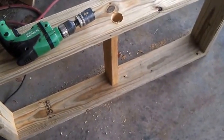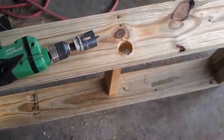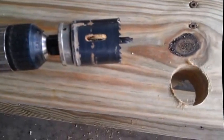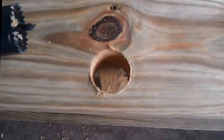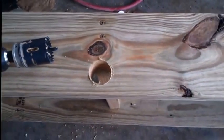After you have your center piece installed, you're going to want to use a hole saw if you have one. This particular hole saw is 1-5/8 inch. Let's cut a hole right there, exactly centered up. This is where the plumbing will come out later.